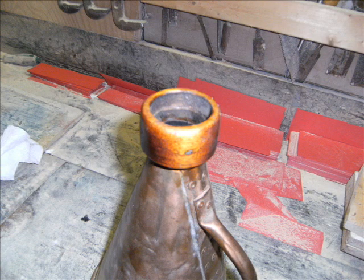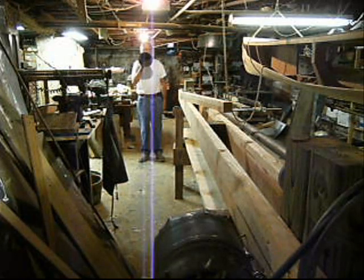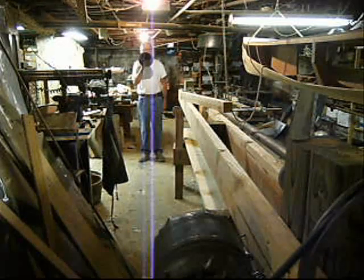For the mouthpiece, I used two hole saws of mildly differing diameters and cut out a mouthpiece from scrap mahogany. The two hole saws used in succession made a neat little cylinder. Some epoxy on the small end of the megaphone, a little varnish, and the megaphone was done. What's the best part of this wonderful old device? "Hello, the steamer! Will you report me, sir?"